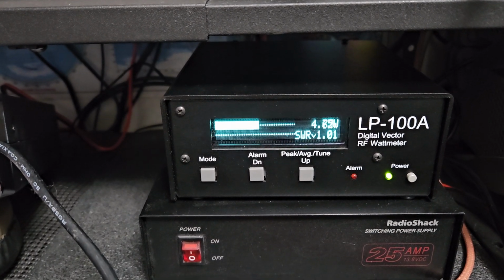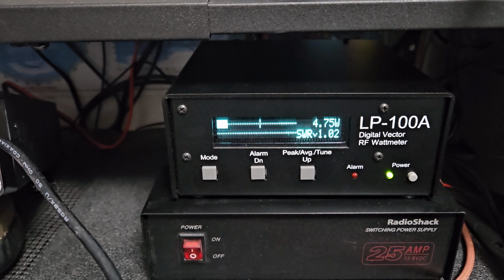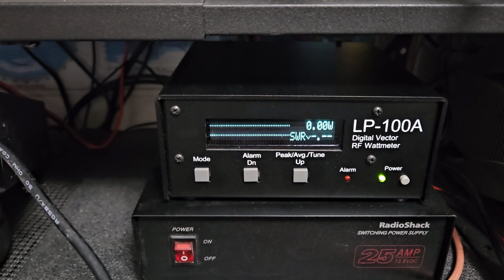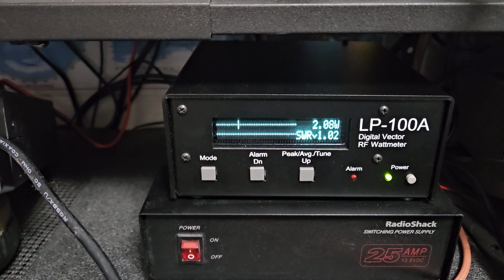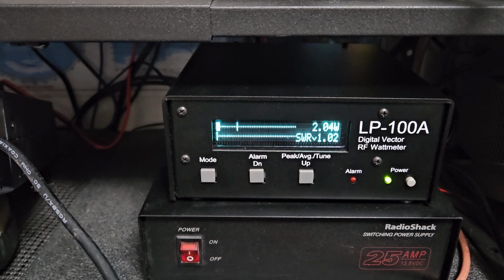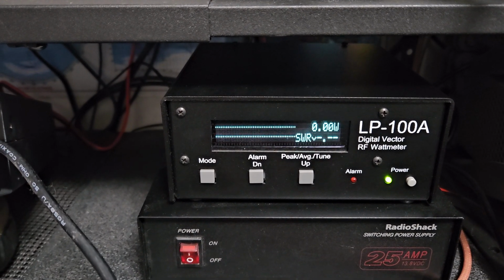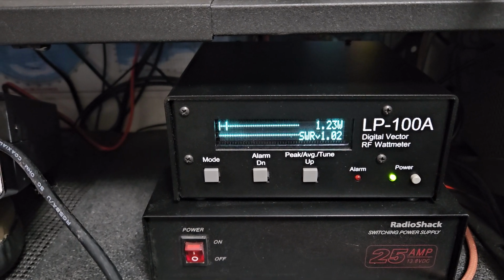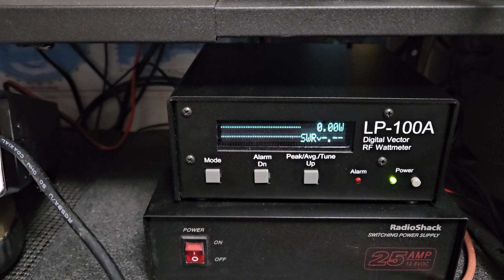25%. 1, 2, 3. That's a little closer to realistic what the dial says, 25%. And then 15%. 1, 2, 3, check, check, which is probably more like half of the 25, more like 12 something percent, but whatever. And then 10%. 1, 2, 3, 4, 5, check, check. So you can see it's a step attenuator.